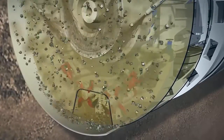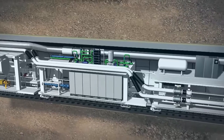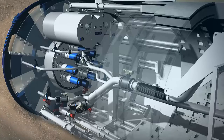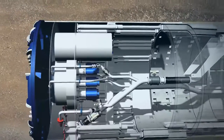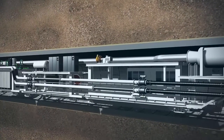The dug-out material falls into the excavation chamber. Small grains are dissolved into the bentonite and bigger stones and debris fall to the bottom. Flushing nozzles guarantee smooth removal of the excavated material, which is pumped through the suction line to the separation plant at the surface. Here the soil is separated out and removed from the bentonite suspension through a centrifuge, and the clean suspension is transferred back into the slurry circuit. As tunnelling advances, flexible extension lines are installed to extend the lines after each thrust phase.